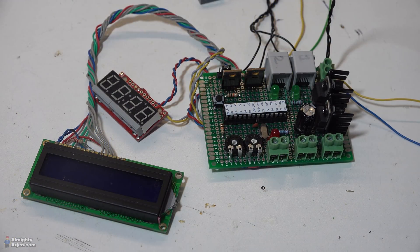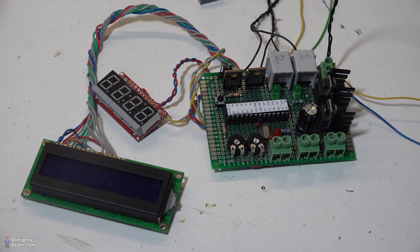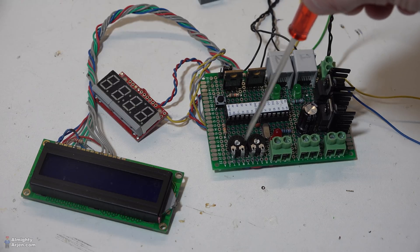I've finished the circuit board. What you see here is a terminal on which we can connect the 12 volt input voltage. Then we have two regulators that make 9 and 5 volts, which are also available on terminals on the outside. We have the Arduino microcontroller in the middle — it's actually just an ATmega with an Arduino bootloader. I didn't include the whole Arduino board because that only takes space. We have two connections for the pressure transmitters, and next to that we have two displays. One displays the actual pressure and this display here shows also the set point next to the actual pressure. Any set point can be adjusted with these two variable resistors.